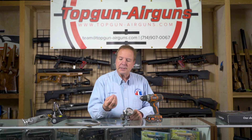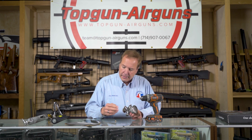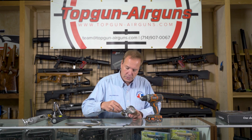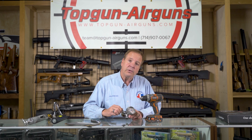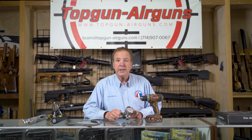Just after you've adjusted this to the amount that you want, you either leave it out if you want 100% flow — which I would not recommend. You can clean the scribe, or you can start to obliterate it slightly if you want to slow it down, then put it back in. And that's how you change the flow of a slow flow valve. This is Joe Brancato, the air gun scientist saying thank you for watching our videos. Take care. God bless. Shoot safely. And please remember to like and subscribe to our channel.